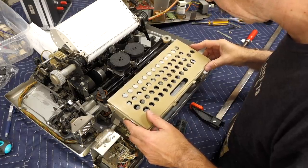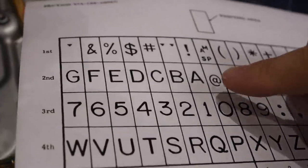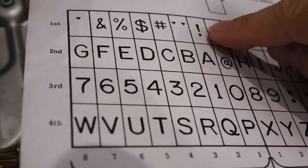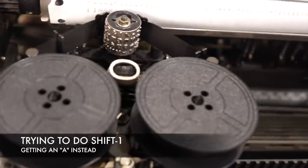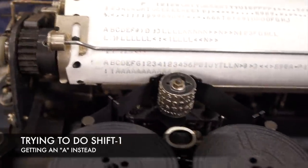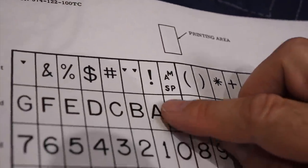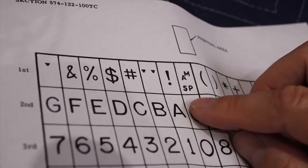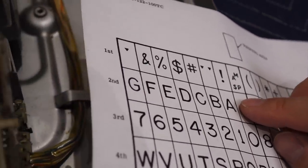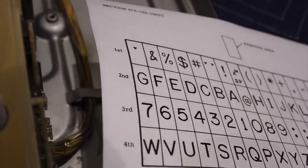But the printer section took advantage of the downtime to develop yet another problem. Doing an A instead of an exclamation point — definitely an A. So I am wrong in my height decoding, which if I am not mistaken, it's bits 5 and 7 that do the height.